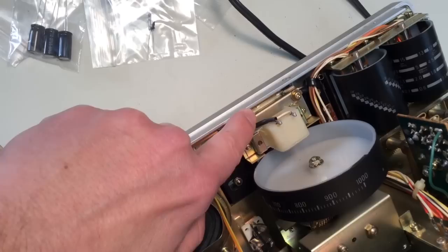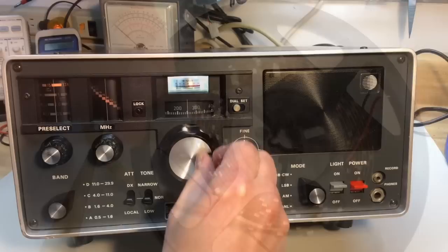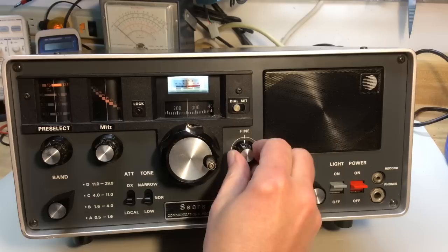I also wanted to improve the lighting on the S-meter, since it was not lit up all that great. I went ahead with some LED strip lights and found a spot on the board right off the main power supply. These are strip LED lights — I cut a section off to use above the meter, and you can see how much brighter the meter looks now.